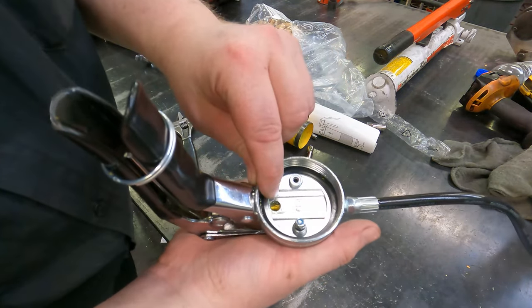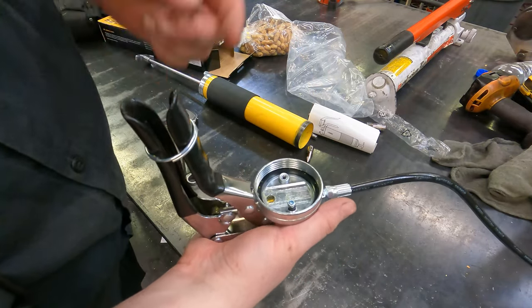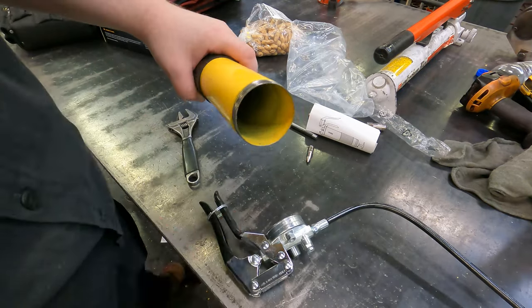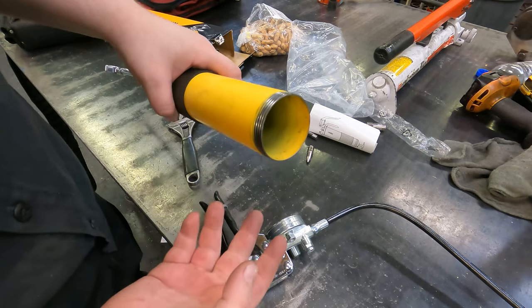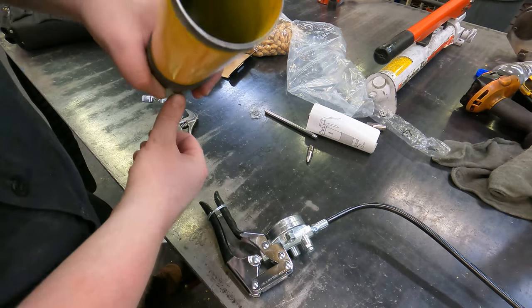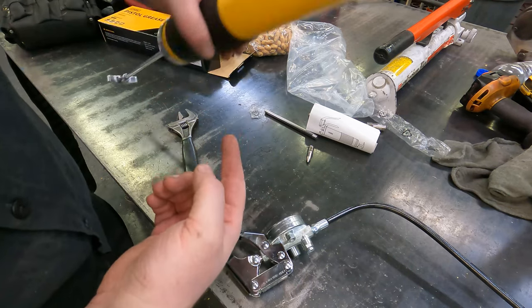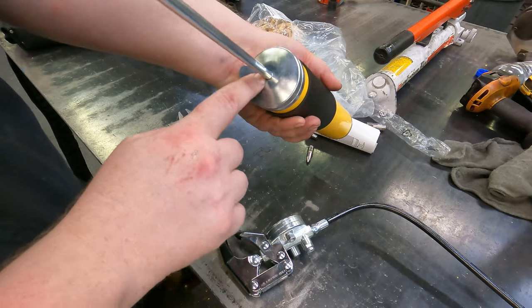It looks like it actually comes primed with some grease in it, so that's good. By pulling this thing off and squeezing it, I actually pushed some of that grease out, so I'm going to fill this guy up. Now I have bulk grease, so I'm just going to fill this, but you always want to put a liner in there. If you don't have a tube of grease, just buy a new tube and put that in first, because you need to make this area a little smaller so the seal has something to seal against. Otherwise, grease will just go behind the seal, and whenever you pull the plunger back, the grease will just come out the end.